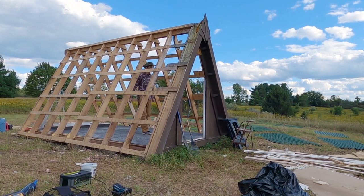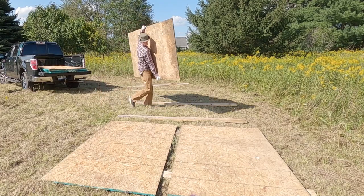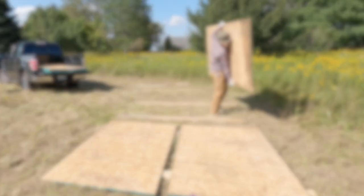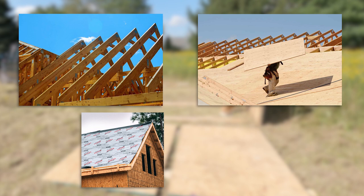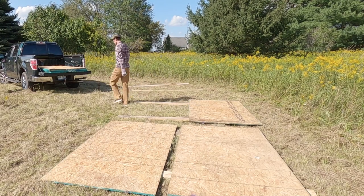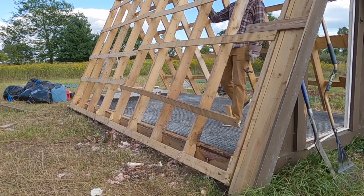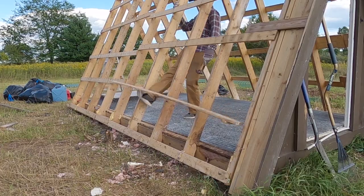The first thing I want to do is put a roof on this thing to keep the rain out. I'm pretty far from a roofer, but I know the basic anatomy of a roof goes rafters, decking, underlayment, and shingles, plus some miscellaneous little pieces here and there. So first I'll start removing these boards that the old roof panels were attached to so that I can put the sheet wood down instead.